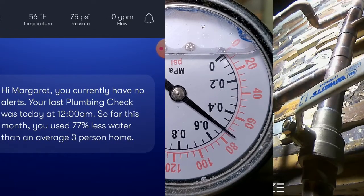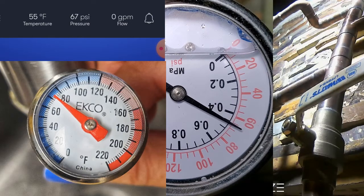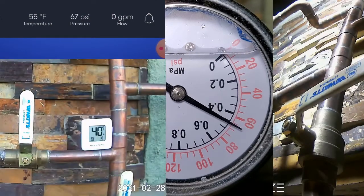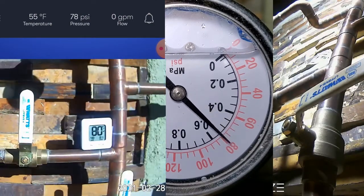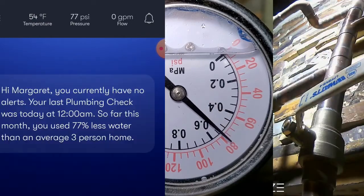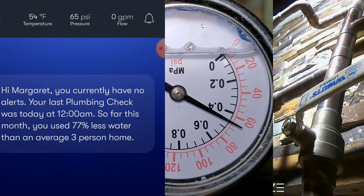This is admittedly a bit of wingnut testing because there are many other factors at play, such as the beginning temperature, the ambient temperature in the room with the water heater, and the temperature of the plumbing within the rest of the system. These all fluctuate throughout the day and even during this longer test and impact the final result. But after having learned so much about thermal expansion, this really proves what goes on when a water heater is replaced, cleaned out to keep sediment from building up, or during other repairs, along with turning off a system for a vacation.